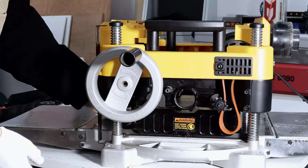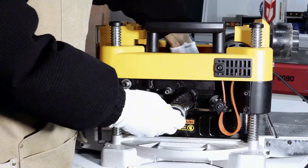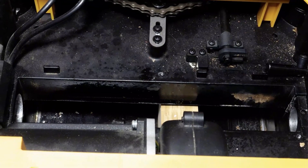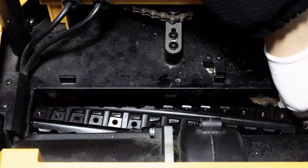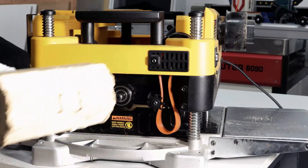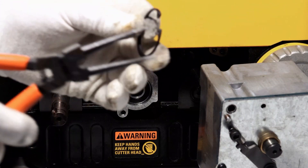Using a wood block, place it underneath the path of the helical cutter head and adjust the height of the unit to hold the block down. Place the cutter head along the mounting hole — the wood block helps tip the cutter head up so the other side aligns with the mounting holes. Using a suitable socket tool, wrap the threads on the side of the large bearing to avoid accidental damage, and tap in the direction of the cutter shaft mounting until the bearing is entirely in the mounting hole, exposing the circlip slot. Using circlip pliers, install the circlip back in place, watching to make sure it falls into the slot.